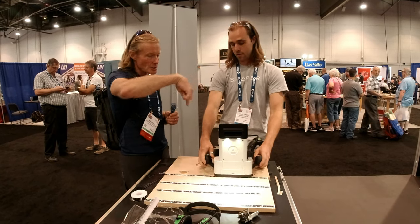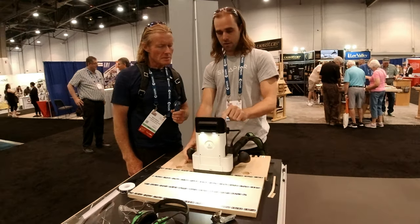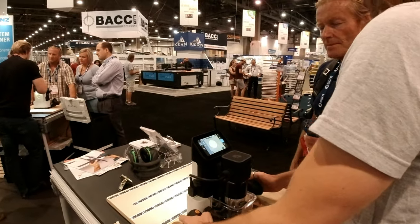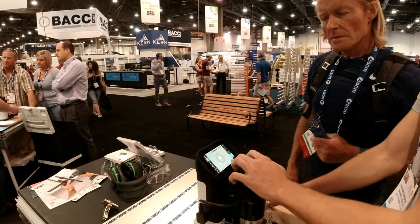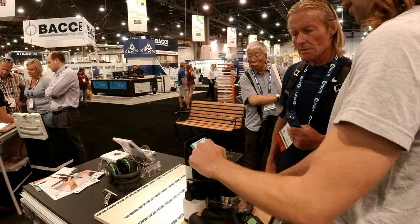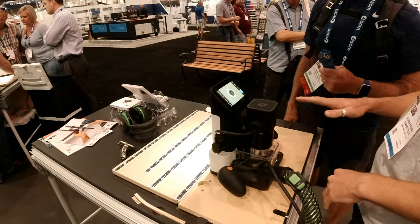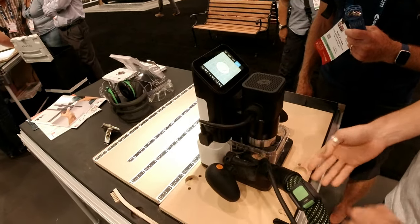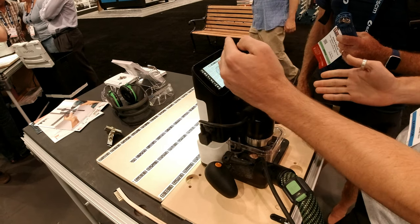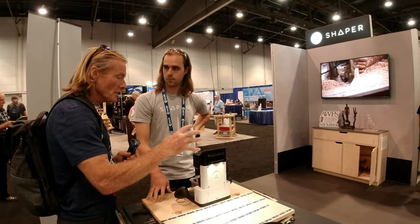If you're building a smart bench and want 20mm cuts, what's cool now that we have Helix functionality is — if I design a 20mm hole, it's a little too big to cut with a quarter-inch bit, but with a half-inch bit you just tell the software your bit is 0.5 inches. It has a z-touch system that lowers the bit until it touches a sensor, so whatever depth you set, it'll cut to that depth — adjusting the cut pass to drill your 20mm holes in one click.